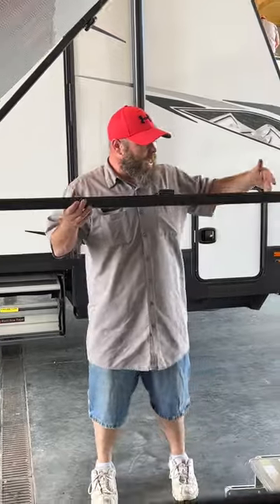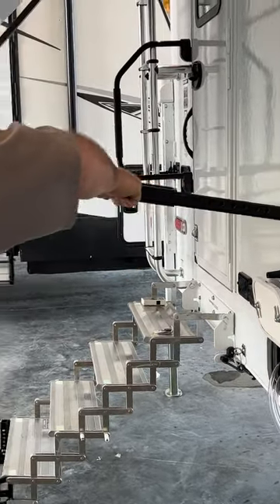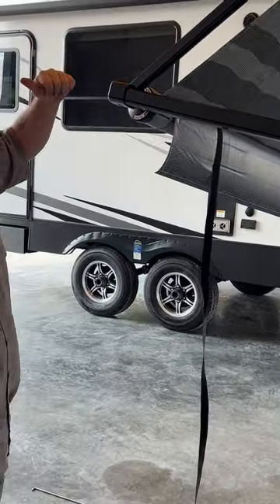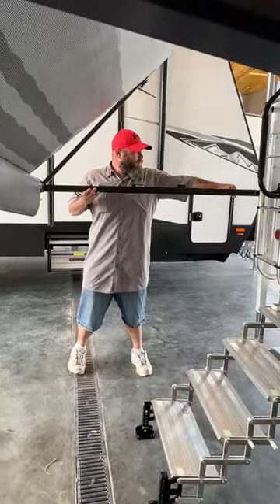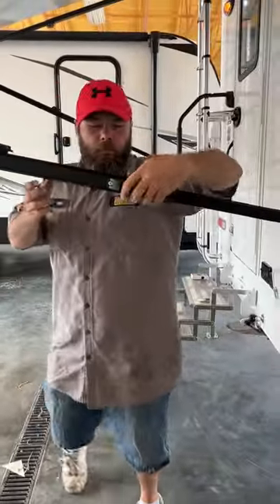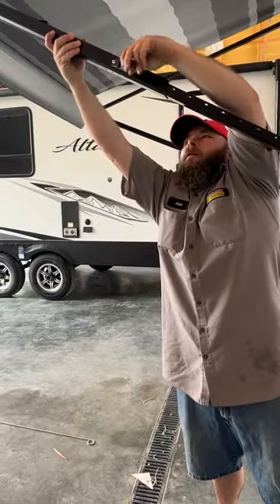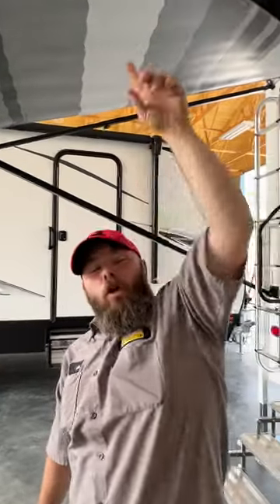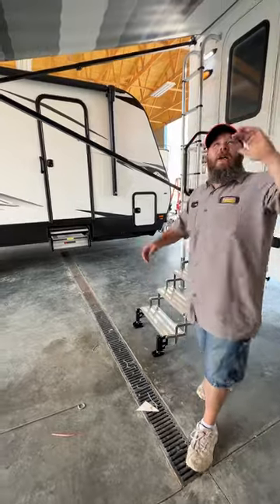From there you're going to be ready to raise this up. Come to this side so you can see me a little better. You're going to have your handle here — basically pull and lift. You've got to do this in a few stages because it starts creating quite a pitch. If you try to go all the way up on one side and then try to go to the other, it's going to snag, so you've just got to do it in stages. When you're on the inside, you can actually see where your last set hole is. Once you've got it to your desired set height, you want to lock those arms good and tight — that little star knob up there. You want to lock that in all good and snug. It makes this really nice and solid.